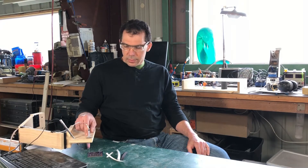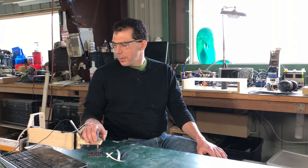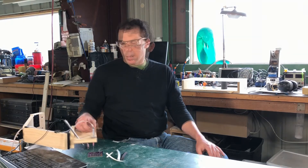There seemed to be a big gap between tweezers and a fully automated placement unit. I came up with this design here, which is really just three hinges, vacuum for tweezers, and a USB microscope. My favorite part of the design is the simplicity — it's very easy to get feature creep and over-design. This is simply a few pieces of wood and some hinges, and it works really well.